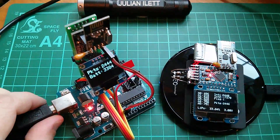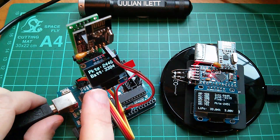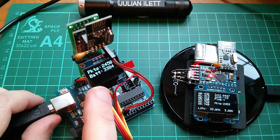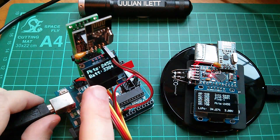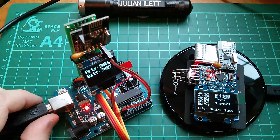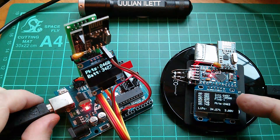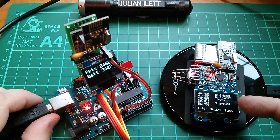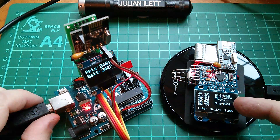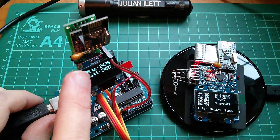I've also now added an OLED to the transmitter, and the purpose of this is to display information that's actually coming back from the receiver. On the receiver, I put a packet count — this simply counts the number of packets that the receiver has received. But the receiver is now sending that packet count, 2,469, back to the transmitter.